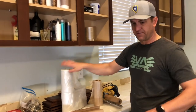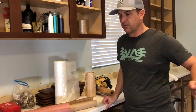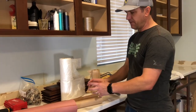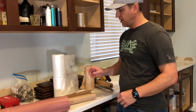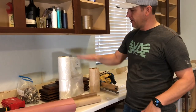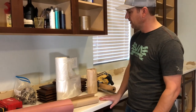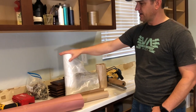So if I'm ever in an area where I know the air from my airless sprayer can ripple the plastic, I do not use plastic in that area. What I end up using plastic for is if I have a big wide open floor and I'm painting around the outside of a room — all masked off. When I do the baseboard in here, I'll mask it off with paper right on the top and bottom of the baseboard, and then everywhere else in the room I'll use plastic just to protect the tile flooring.